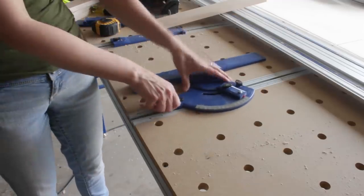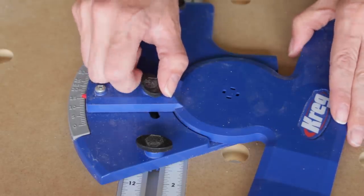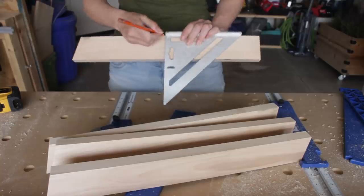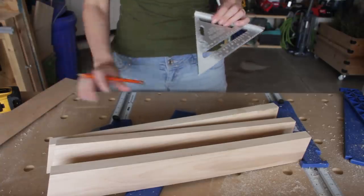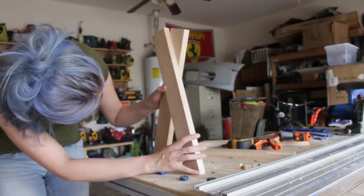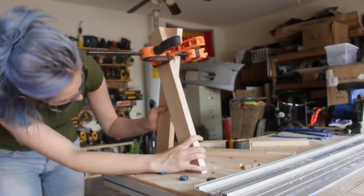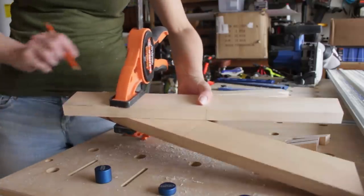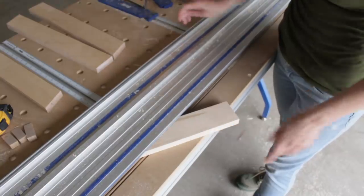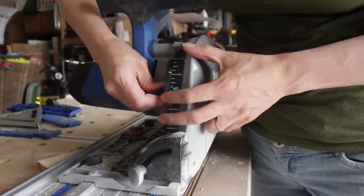Since I designed the legs of the wooden base to sit at an angle, I brought out the miter gauge and adjusted it to 15 degrees off square. I then angled the bottom edge of all four boards. I measured seven inches from the short side of the cut and made a pencil mark to indicate where my boards were going to intersect. I planned on connecting my boards together using a half lap joint — the half lap joint removes half the thickness of each board in the area where they intersect. I aligned the boards on my work surface, clamped them together, and used a pencil to trace the edges. I simply aligned the edge of the cutting track on my pencil marks and set the plunge depth of my saw to 3/8 of an inch, which is half the thickness of my boards.